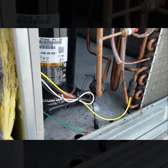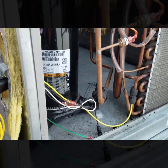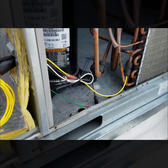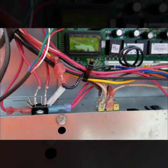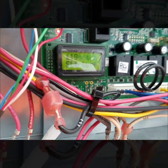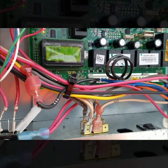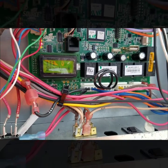Without going without saying — as I usually mention in all my videos — when you're doing any wiring or anything with electrical, kill power to the unit. I shut mine off at the disconnect up here on the roof while doing all my repairs. I'm going to go ahead and turn it back on now. Typically when you fire these back up it goes into a reboot — it takes about 120 seconds, so it'll do a countdown.